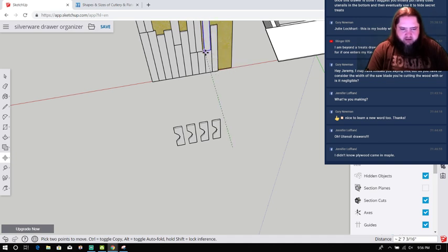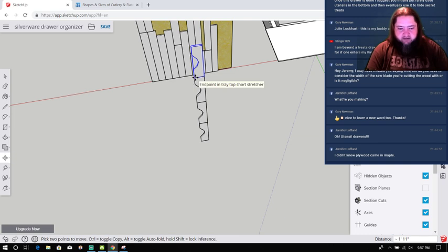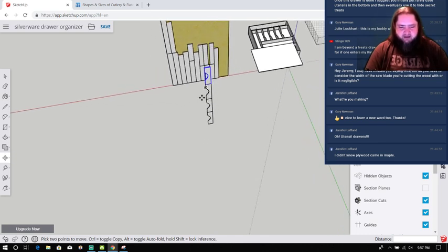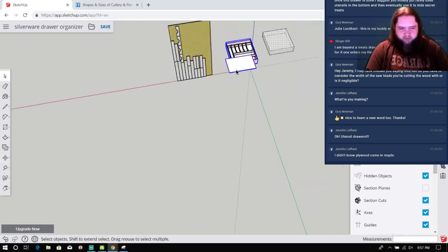But I think I'm okay here, because I know what material I have available. Did it again. Now these pieces will actually be cut out of squares first, or rectangles, I guess. And then I'll tape the four of them together and cut the curve all at once out of all four of them on the bandsaw. At least that's the idea. That's the way I saw the other guys do it. Let me put it that way. There we go. And then the final piece here.